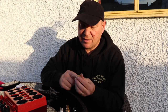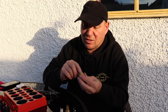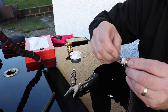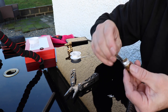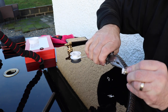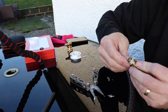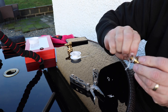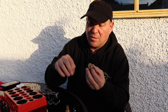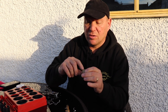Once you've got your O-ring in, it helps to put a bit of silicone grease around the inside of that O-ring — that'll just help it spin on there. Make sure you've got all your old PTFE tape off so that doesn't clog anything up. You can then push the center piece back in through there — it just slides in.